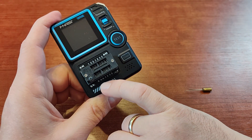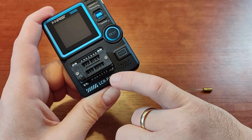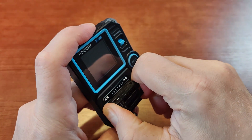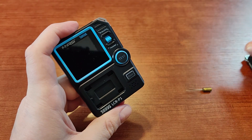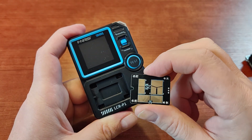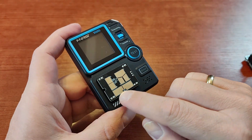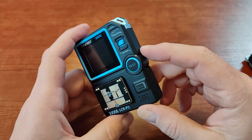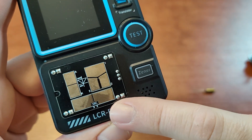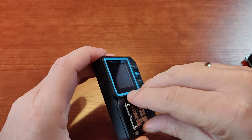For diodes you will be using the cathode and anode connectors over here. You also have an additional set of 1, 2, and 3 connectors here if you'd like to replace that adapter with the SMD adapter. You just need to pull it out like that and insert the SMD adapter. Take note that there is a key, so you cannot insert it the other way around, and it will not go all the way down because then it would be very hard to remove. For SMD components you can see the descriptions on the board — it works the same way, but you just place them lying flat on the adapter.